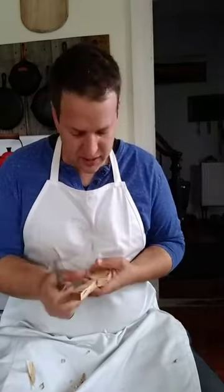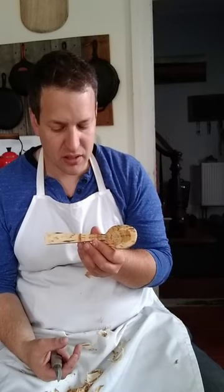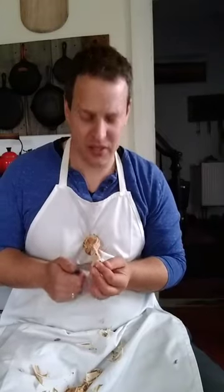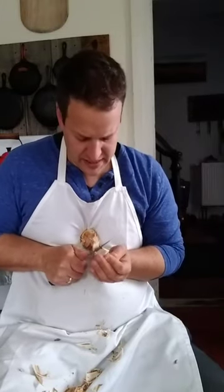Yeah. So you can see also, this sapwood is harder to carve than the heartwood. And part of that is this grain orientation also. This is something I've talked about where I'm diving down through growth rings. No, Jerry, it's just the cherry sapwood. Cherry sapwood often has these, I don't know what they are, inclusions of something. I wonder if they have something to do with this. I think they have a little more scent than the rest of the wood, but I don't think they necessarily serve that purpose. I think that's just coincidence.